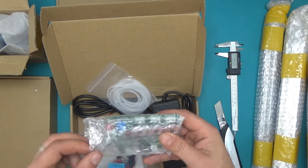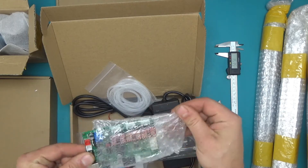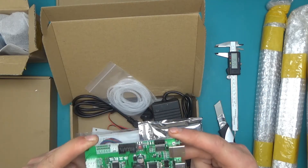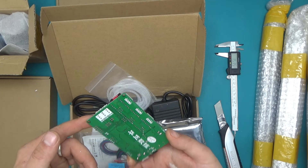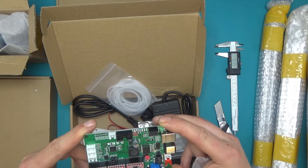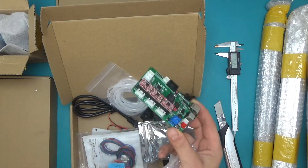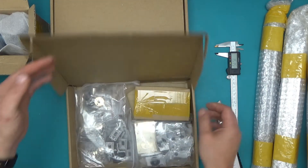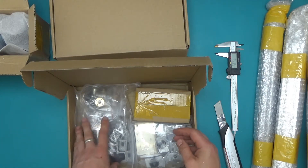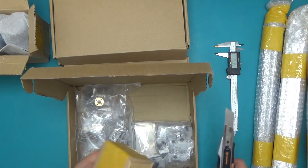Here is the drive — it's amazing how little circuit board there is to it. This is based on an Arduino Mega with three little stepper drivers. Pretty much that's all it is — amazing, that's going to be fun to work with. This machine works using Gerber software. The last box — I think that's the motors, and yes, those are the motors.